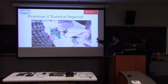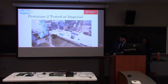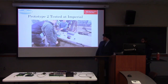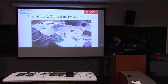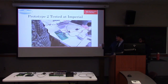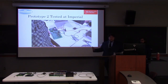We have a video of this working at Imperial. This setup is connected into their dust collector, wired directly into their control panel, running in manual mode. When you see the LEDs pulse, you'll also hear a loud bang in the background — that is the compressed air going through the solenoids into their dust collectors, cleaning the filters. There's a pulse — it worked. This is exactly what we needed, virtually the same as what they already had, just in a form they could build upon.